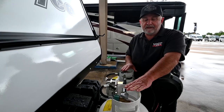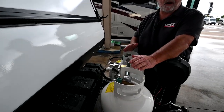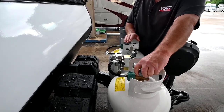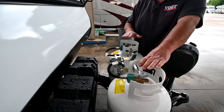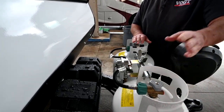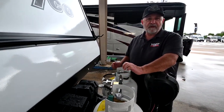That's pretty convenient, except when it does run out and it switches over, you're not going to know. So then you could be in for a surprise a couple days later and you're totally out of propane. What I suggest is leaving one bottle turned off. That way when this tank runs out, you know you're out. You can come out here, switch the lever to the other tank and turn it on, but at least now you know you have an empty tank. So if you go into town, you can take this tank with you and fill it up.